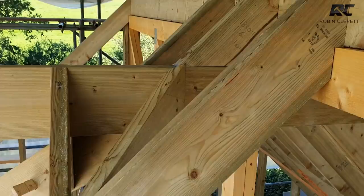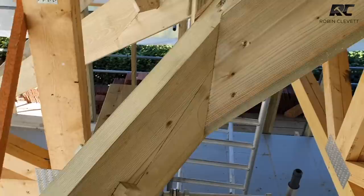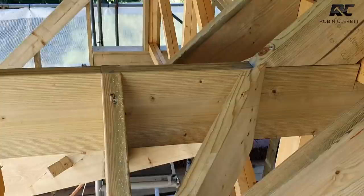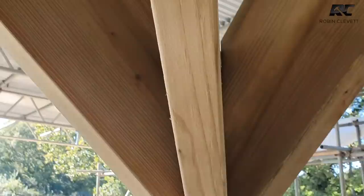That's what the tiniest jacks look like. So they all meet on the valley. This one's lovely because it's clasping part of the scarf joint, as will probably the next pair. And they all line up. So they line up over the top, down the bottom, and back up. And that's how these look. So now I know, because they fitted an absolute treat, let's try and get underneath here. Because they fitted an absolute treat, I know that every single rafter now will fit.